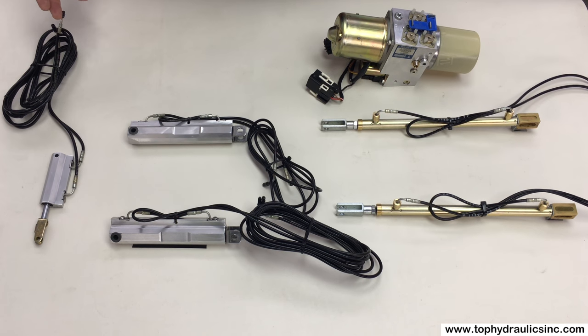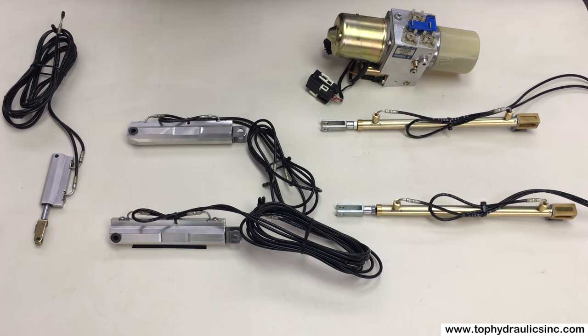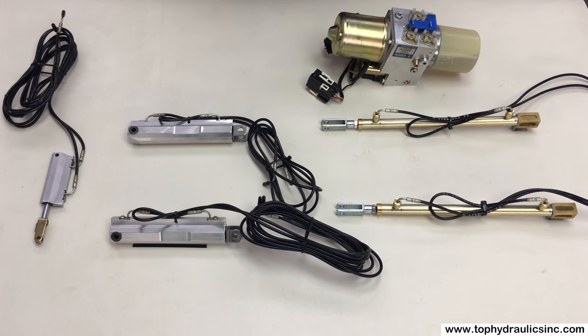We actually make these parts better than new inside. Our seals will last three to five times as long as the original ones. Our seals are not sensitive to water from condensation in the system or to people having used Stop Leak. Using Stop Leak additives in your hydraulic fluid creates a big problem: it initially makes all the seals swell up a little bit, but the chemical composition of the seals gets changed, and ultimately these seals get softer and softer and just fall apart.